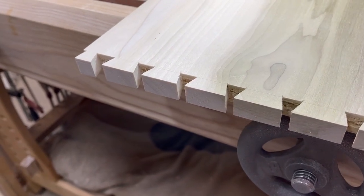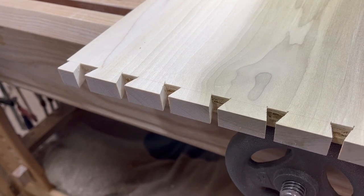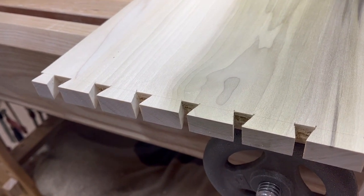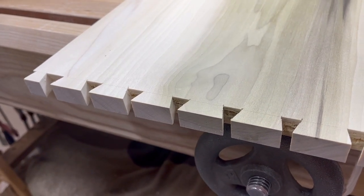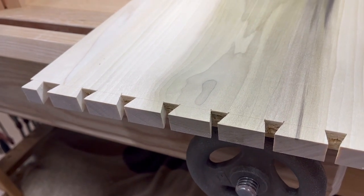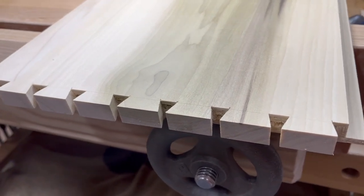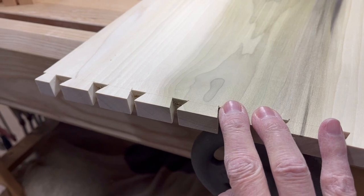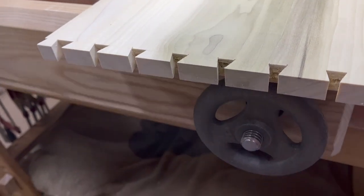Make a couple of shop cabinets with a lot of drawers, and do all hand dovetails. After you do that, then you'll be able to do these pretty quick. You know, all the jigs for doing it with a router or whatever, it takes so much time to set that up that really, you have so much more flexibility by being able to do it by hand. And it's all about being able to saw to a straight line.